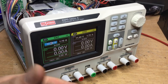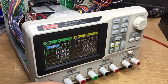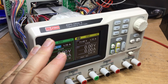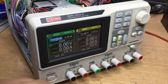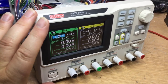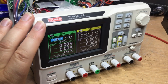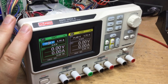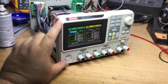But as you've just seen there, it powered itself off. I've then gone and sprayed circuit freezer on the bridge rectifier directly and it's brought the power back. So it does look to me as if there's some relationship with the bridge rectifier or those regulators in that area, but we'll need to prove it. It's just a shame that in order to see the fault again, I've had to reassemble it all and put it back together. Usual thing with these faults, sometimes they're difficult to pinpoint. I sort of convinced myself it was to do with those capacitors, but I think that's only part of the issue.